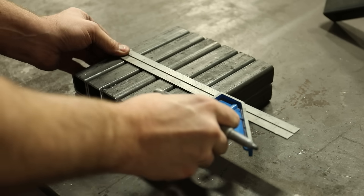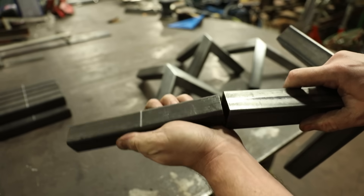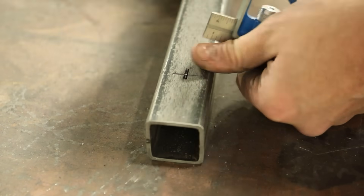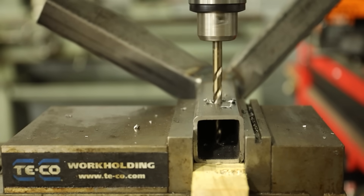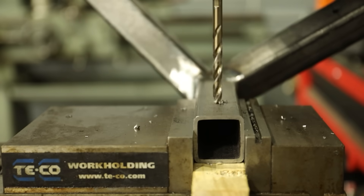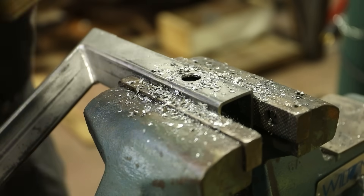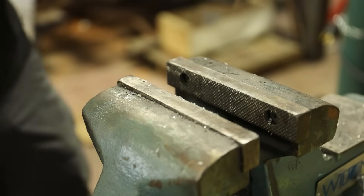After the corners were all set, I needed to add inserts. These would simply slip halfway in and get plug welded. Measuring from both sides gives you a truer center. These could have been through bolts, but the plug welding is cleaner and there's no need to keep track of any parts.